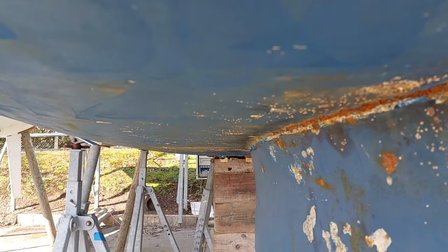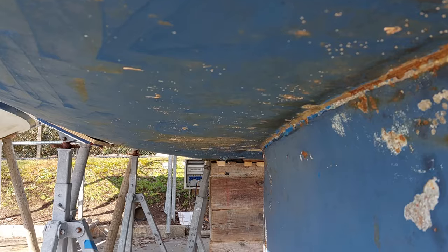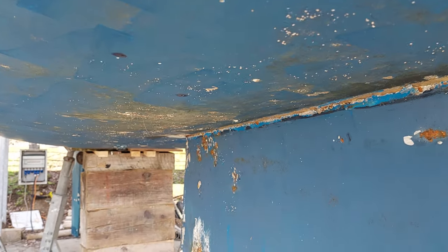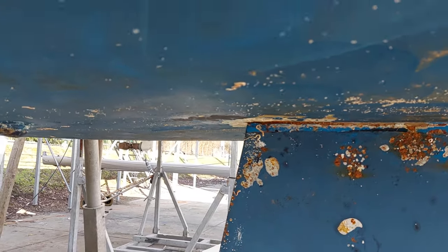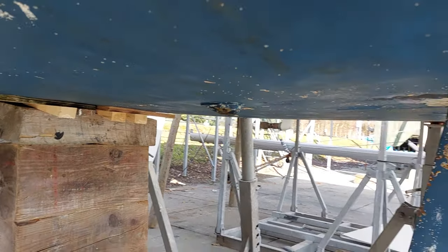If you look down here and follow the plane line to the hull, you can see how the hull drops down — where it sags. We've had a load of support put in to try and help support the rear end of the boat, because basically all the internal pan moulding has let go and there are quite significant fractures all the way in. You can see how much the hull is sagging up from the failure of the internal matrix, and we've got all these chocks and blocks in the way.